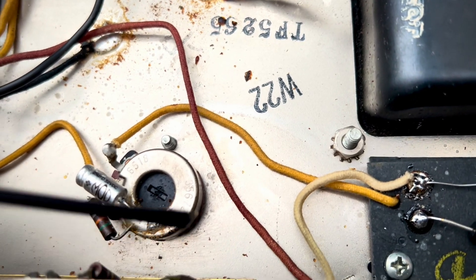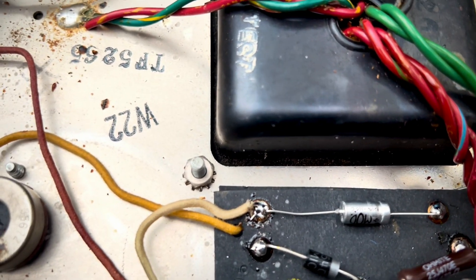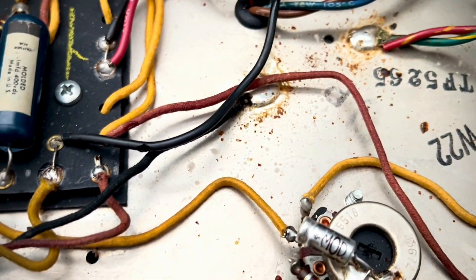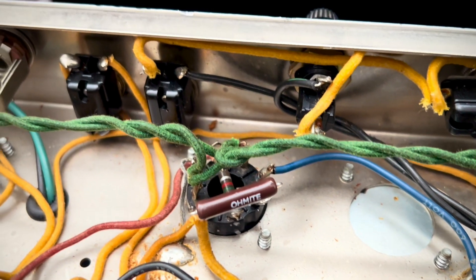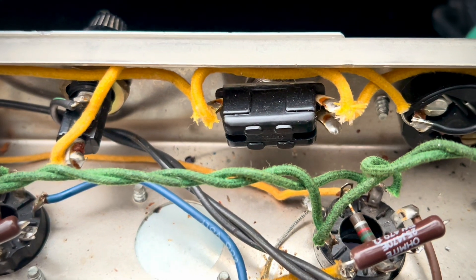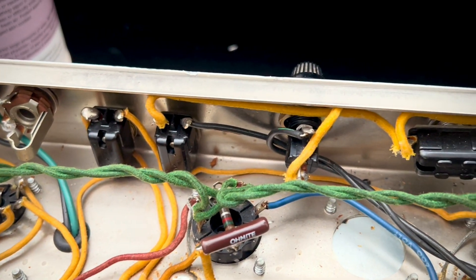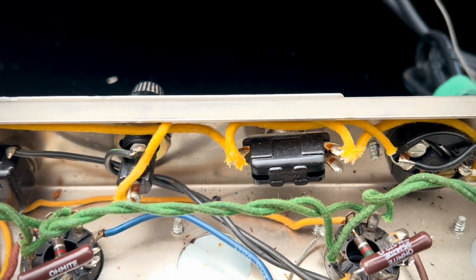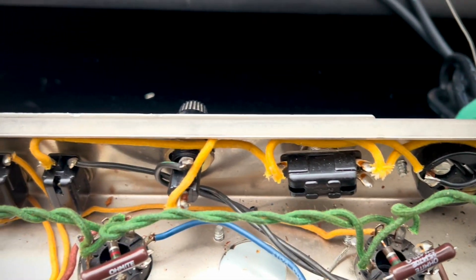It's gonna be a little messy for a moment. I did remove and repopulate your bias supply board — your rectifier board. You have some nice little yummy ingredients for your day. And here you can see I ran another little filter node off of your bias pot. I have some new screen grid resistors here with a nice air gap, and your actual grid resistors themselves are spot on, which is quite surprising given they've been baking for decades — so I'm gonna leave them be. Gonna have to fix the actual wiring of your power cord, which I didn't notice initially because I was working from the other side of the chassis. The dude that was in here prior installed the power cord but didn't do it in the safest manner possible, or at least up to current code — so I'll go ahead and repair that.